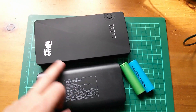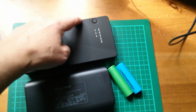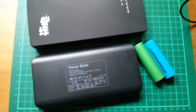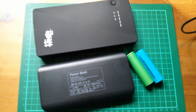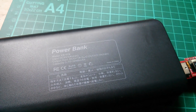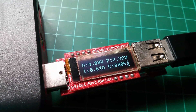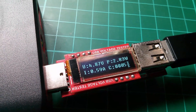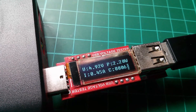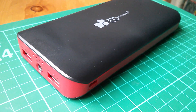Compare this — what I think is an eight-cell power bank — with the rather bonkers six-cell power bank I bought some time back. The six cells are just laid out there with a very large circuit board, whereas this must have quite a small circuit board. Eight cells, 22 amp hours — that's just awesome. I'm going to use it for a few days to charge my devices. My phone, which I'm filming on now, is plugged into it right now drawing half an amp, with voltage hovering at about 4.9 volts and about 2.5–3 watts.